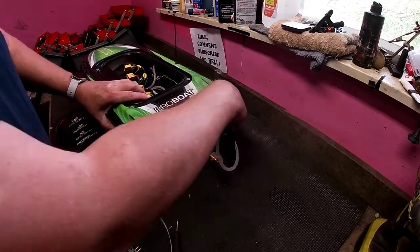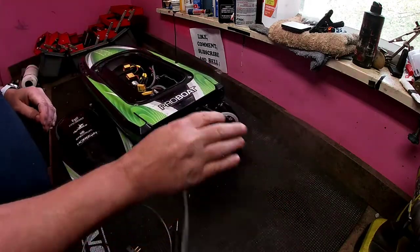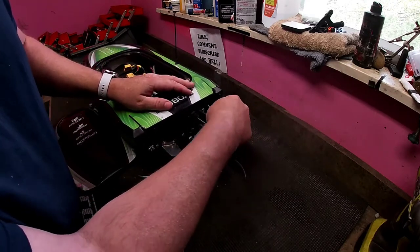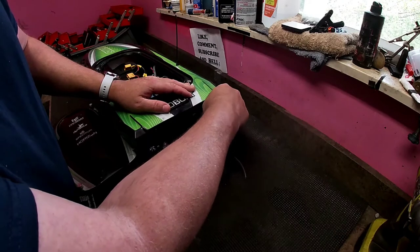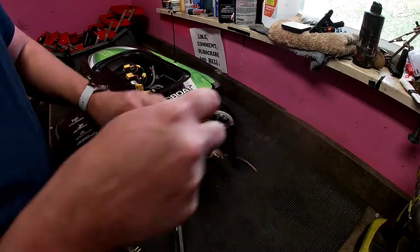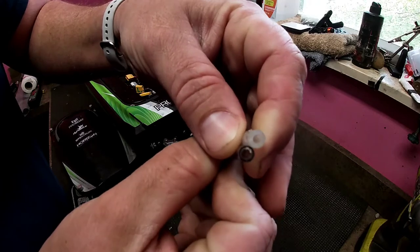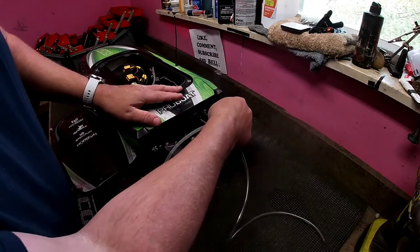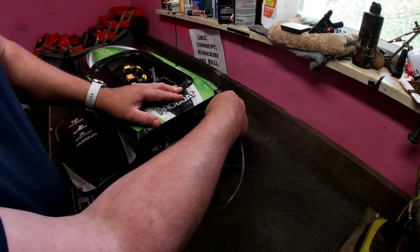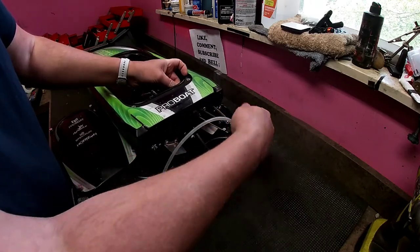First thing you're gonna do is pull your old tube out of the boat there. Now this tube going into this hole is the tiniest bit smaller than this one. So when I put this through the old hole, I am going to add a little bit of some type of silicone or shoe goo or something to make sure water does not get back in there.